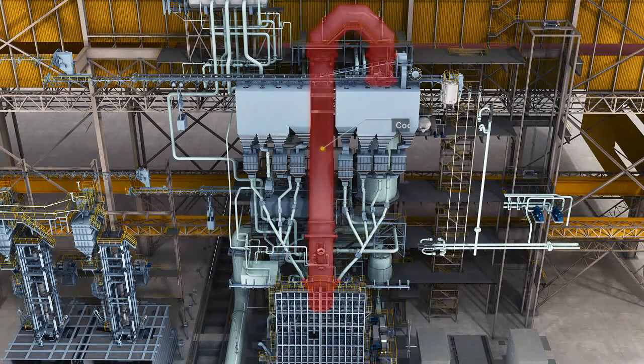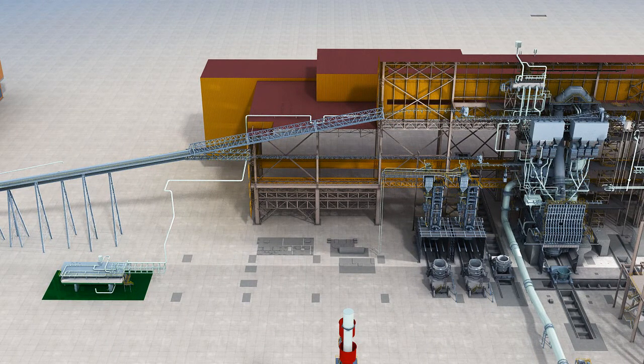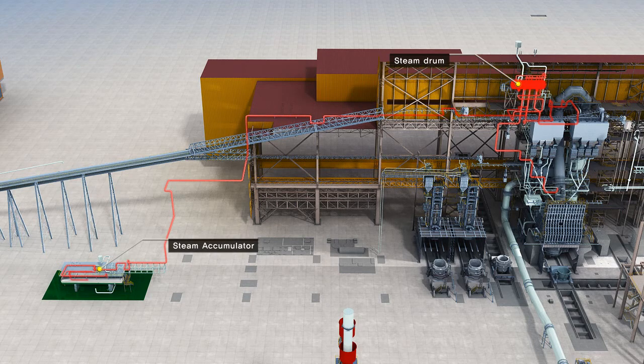The cooling stack over the hood, located at the top of the skirt, receives a lot of radiation heat and consists of membrane tubes for cooling. The off gas temperature at the converter mouth during blowing is approximately 1500 degrees Celsius, which is cooled down after passing through the hood and cooling stack. Radiation heat exerted on the cooling stack will generate steam through the boiler system, and the generated steam is stored in the steam drum and steam accumulator installed outside.